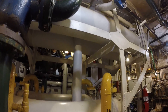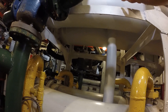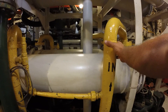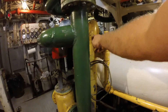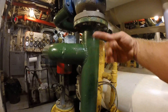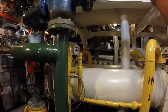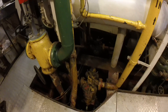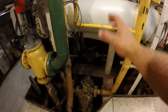Up above in the center between the two engines is your fresh water cooler for the water that runs through the engines — there's one for each engine. And these are your lube oil coolers. You have your oil coming in from the bottom of the engine, running into this cooler, being cooled, and returned to the engine. This is the raw water — river water or sea water — that's continually pumped in and out and flows over the side of the ship, providing cool water for the lube and fresh water. Down here is a strainer — it's redundant; you can isolate one side to repair it. It's a set of disks that filters out debris and contaminants in the oil.